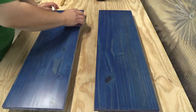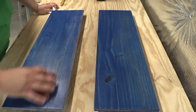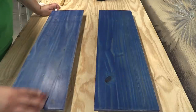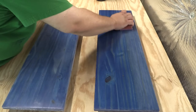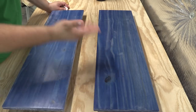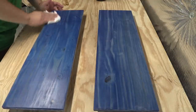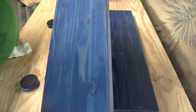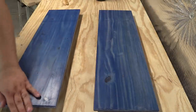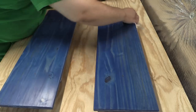Sanding with the grain, letting just the weight of the sanding block do the work — not applying any additional pressure. You'll notice this time it's not getting as white; not as much material is coming off because we are only now sanding into the finish we've applied. It's up and down with the grain, a little bit of overlap. We'll take our slightly damp rag and wipe the material off. You can see we got down in some places, but by and large this still has a pretty smooth feel overall.